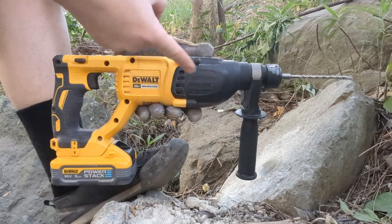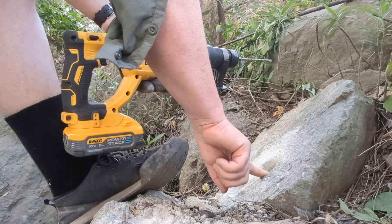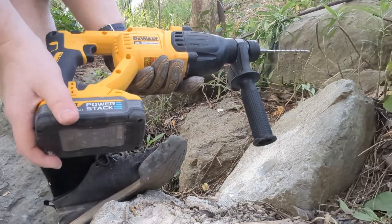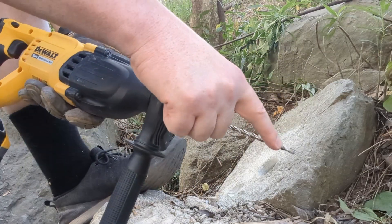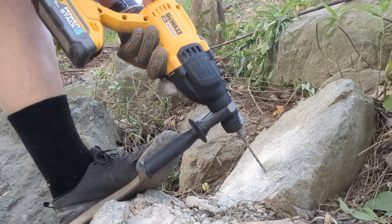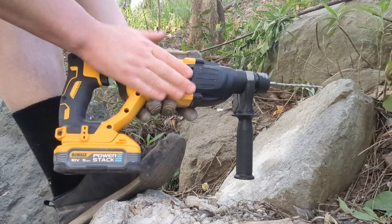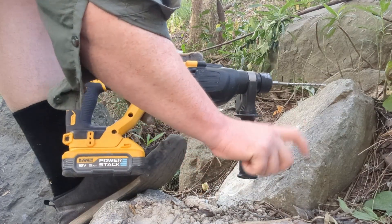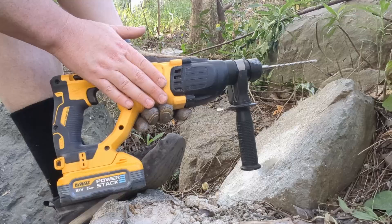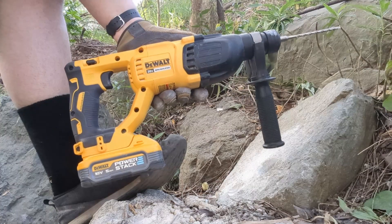All right guys, so I am back. I just wanted to try one more thing. So the viewer question was about whether you can use this specific drill to drill that size hole. I don't know what kind of stone they're working with — it's probably not this hard — but let's try and finish this job off. I'm going to try one more thing with a six millimeter bit: I'm just going to work out some of the material around the outside of that hole, and see if that helps, because the impact force isn't quite enough to work with that size hole in this particular stone. If this doesn't work, you can just go and hire an SDS Max drill and that should get the job done pretty quick. But in the interest of completeness, let's try and finish her off.